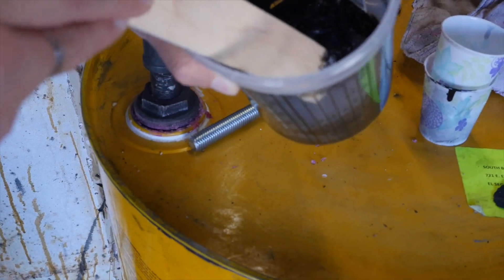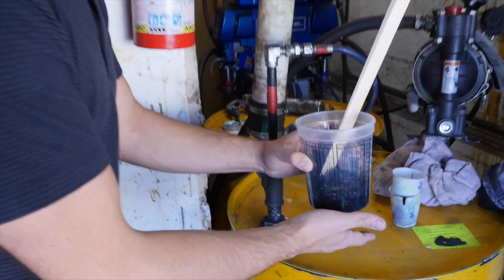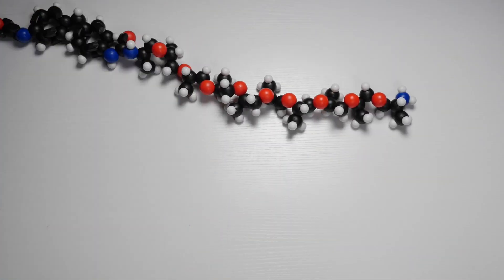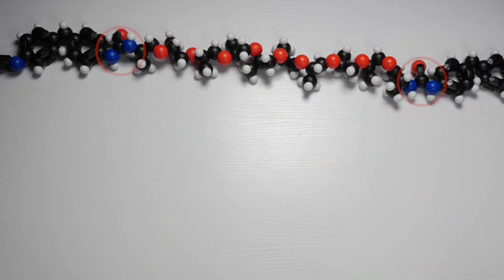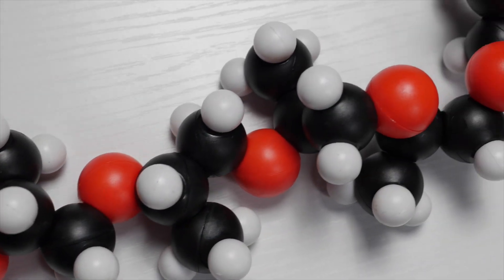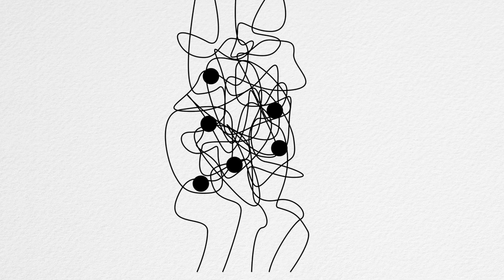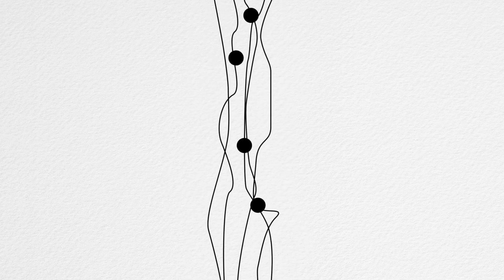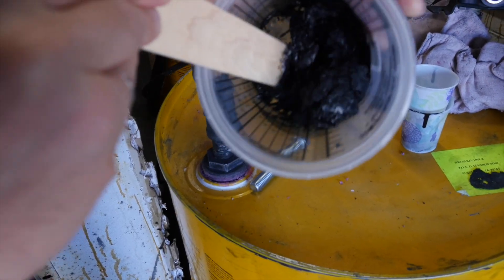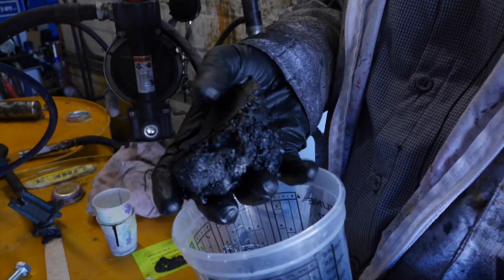The bottom is very hot. What's happening is the molecules of A and B are reacting to form long chains. Where they join, they form a urea group, so the substance is called a polyurea. The structure of these chains is responsible for the properties of the coating — it's hard because it's made of a tangled mess of molecular threads, but flexible because these threads can be stretched out and then snap back into place. The reaction is rapid, only taking seconds, and it's exothermic — a lot of heat is given off as these bonds form.